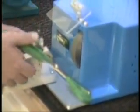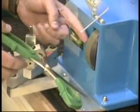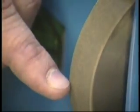The Corru-Gator comes equipped with the same standard arm that comes with the Twice As Sharp, and it has a wheel on it that has a tooth pattern. The tooth pattern will create about 72 teeth per inch. It's about 3/4 of an inch wide, and it's coated with diamond. Also, the grooves that cut the teeth are set in a spiral pattern.